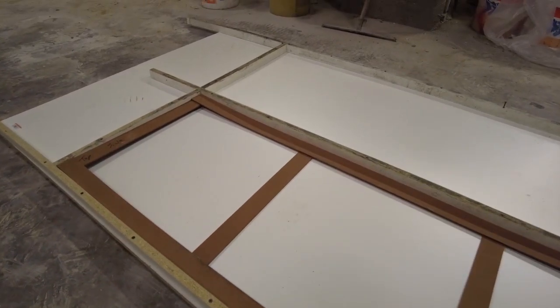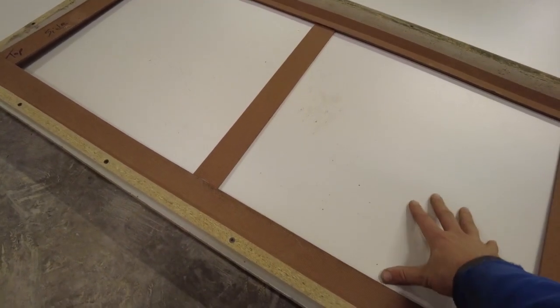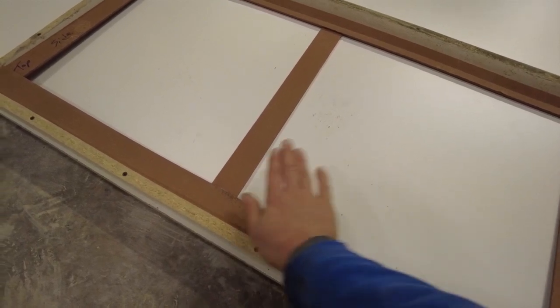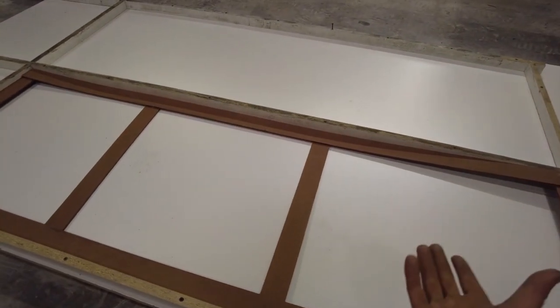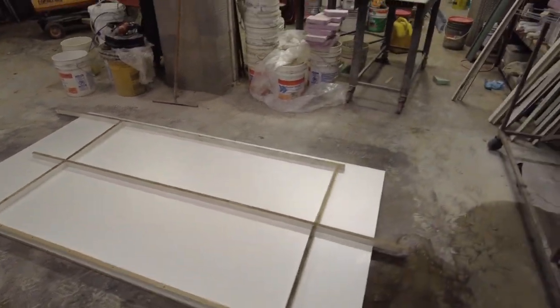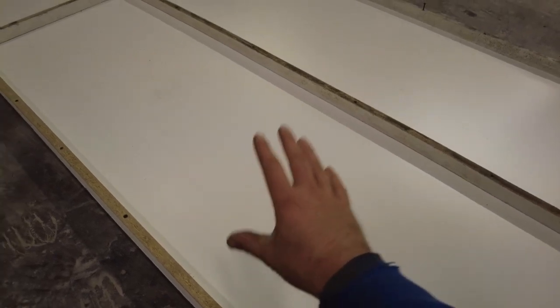Whenever you form them, you need to make sure your template gets flipped upside down. So whatever surface is touching the melamine is eventually going to be the top, and the side that we trowel smooth is going to be the bottom. So you basically just flip this over after you pour them. So you need to make sure that your base melamine is, sorry, I'm hanging that template back up. You need to make sure this area is as clean as possible and defect free.